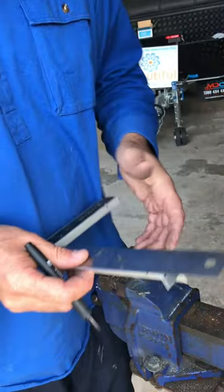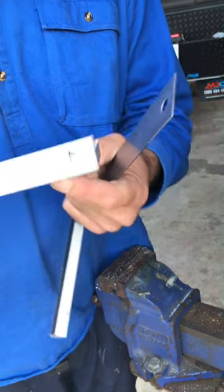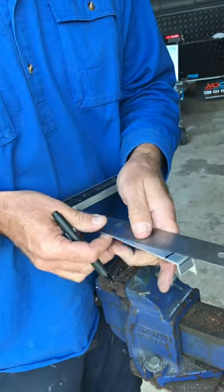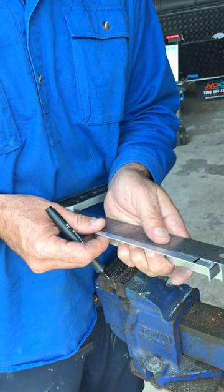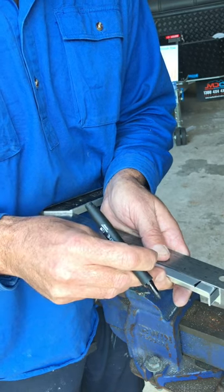All the way down. Grab your straight edge. So obviously that's the front. That bit there, this bit underneath, we've got to bend down — and that's the one that's got the two rivet holes to go into the van. So we've just got to go down and put the straight edge on it like this. This is the overlap that folds back down again, so you just put it to wherever you want to have it.